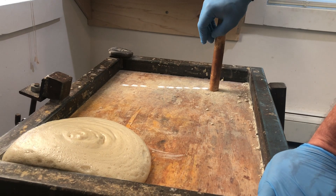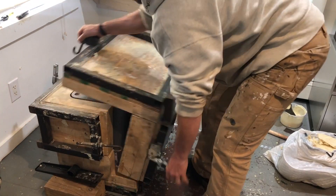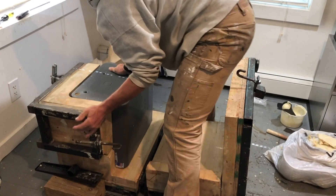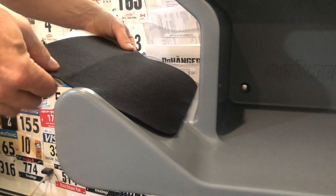This part does have to support the weight of a bike, so figuring out how much foam goes where, where the vent holes go, and how long to pour on which side was one of the hardest parts. The part sits in the foam fixture for about half an hour to make sure the high-density foam is fully cured. Then we pull it out, drill out the back foam holes, clean up any excess foam, wipe it down with a polisher, and install our felt pads. That's the finished product — a lot of hands touch these parts, and I hope this makes sense on how it's made.